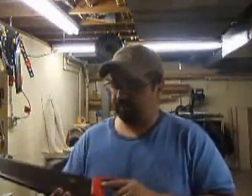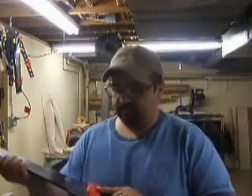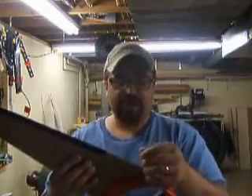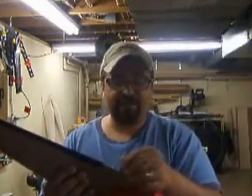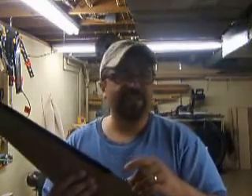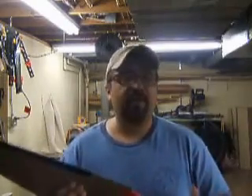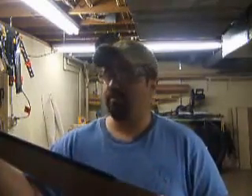When it comes to choosing a hand saw, think about how many teeth there are — teeth per inch. Just like with our table saw and our miter saw, you're going to have a specialized cross-cutting saw. This one has about 12 to 15 teeth per inch. It doesn't make a very fast cut, but it makes a very clean cut. It still needs to be cleaned up a little with a block plane or a sander. But right now I'm just using this to get to rough dimensions.